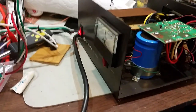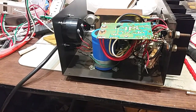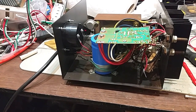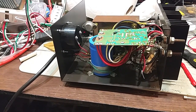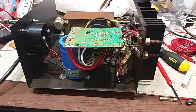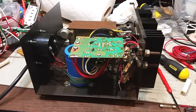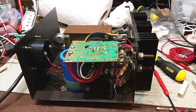The Astron is a good supply. You'll see some people swear by them; sometimes repeater builders don't speak so highly of them. For a hobbyist — CW, key down, key up, or single sideband where the most significant current is drawn on the voice peaks — these aren't really stressed. Repeater builders talk about derating to half their rated current. This is a 20-amp supply; they might use it only for a 10-amp application. I think that's fair for FM, because FM draws full power while transmitting — the carrier is at full power, it's just the frequency changing slightly.